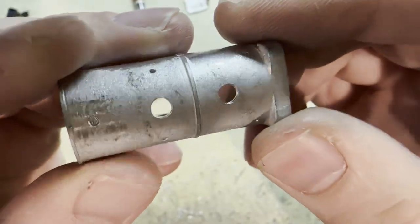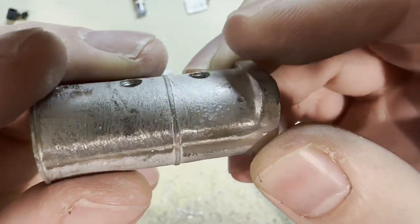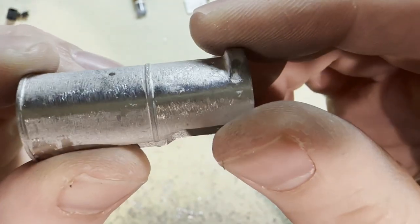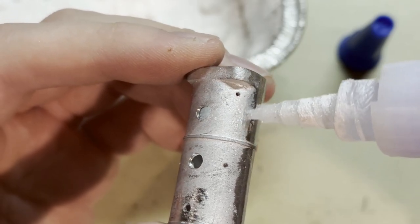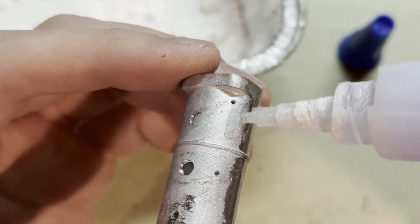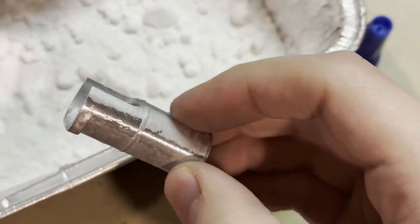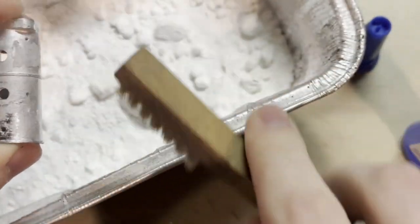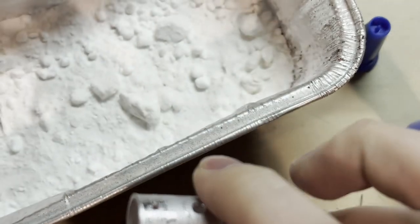The last main holes I'm putting in the boiler are just for the handrails, and a 0.8mm drill bit seems to be doing really well for that. After taking a closer look, I found the boiler does have some pitting around it in certain places. So I'm going to fill that in and sand it smooth — that'll help this to look a lot better when it's painted. I'm just going around there putting on a thin layer of liquid super glue, then rolling it in the baking soda tray.